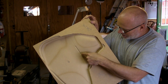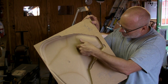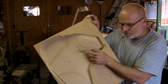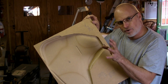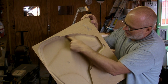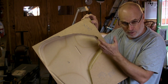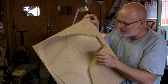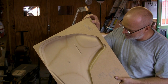It reads codes ahead in the G-code, and I think it thought it was lower, so it lowered the Z axis and started to cut, and I stopped it. What I should have done — and what I did to get the rest of it cut — is scroll back up through the G-code on Mach 3 where you can see where it's going to cut. Once it was back up in position, I found the line that had the X and Y coordinate on it. Then you have a button that says set this as your next line, hit go, and man, it went right to that spot, lowered to the right level, and continued on beautifully. That seems to work.